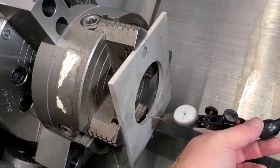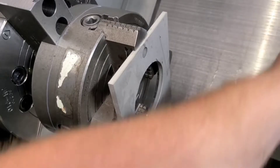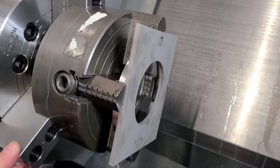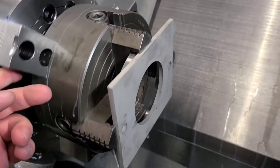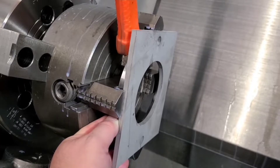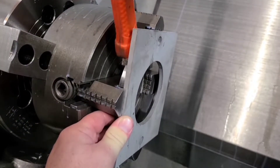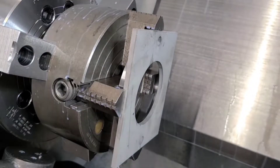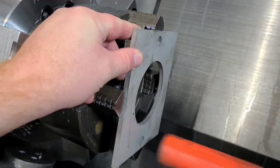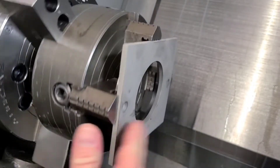Since we know the spacing ring was not tight, we need to tap it to ensure it doesn't move while machining. Place it roughly in the center of the travel, then tap on the face of the part until it's seated well. Once everything is seated with the spacing ring, you have to make sure the face is still running true. I would put an indicator on the face if it's a part that matters.